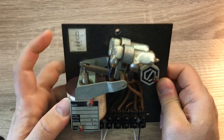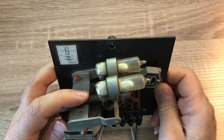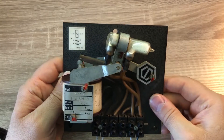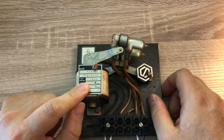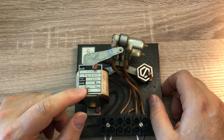But when the coil is energized, this one is moved downward, and the mercury flows toward the left, creating connection between the two terminals. This coil you have to energize with 24 volt DC. It has 160 ohms, so it draws a little bit of current.